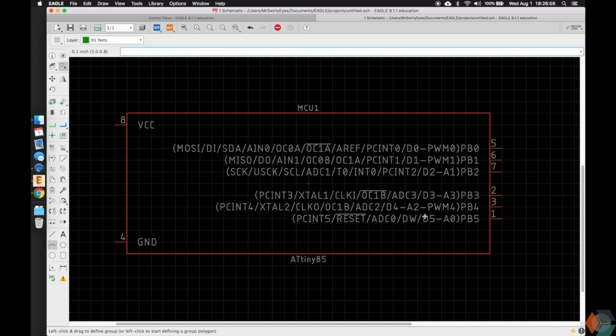You can actually use these pin numbers. So A0 is pin 5, this was just to show digital. So you would use pin 5 if you want to use it as a digital pin, but you would type in A0 for your pin defines in Arduino as A0, etc. with the other ones. This other metadata is a little more confusing, but also meaningful in some other ways.